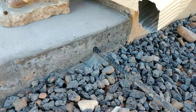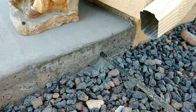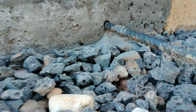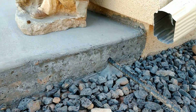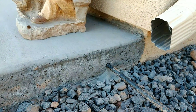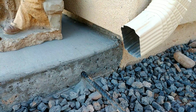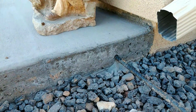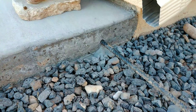Generally speaking, you want the rebar on the bottom half of the slab where it can tend to stretch the most. Drill it about 2 inches down, maybe a little bit further. You don't want to drill it too close to the top because it could chip out. Same with corners of concrete — you want to keep it 6 inches or more from the edge of whatever slab you're drilling into. This is number 4 bar — it's a half-inch thick.